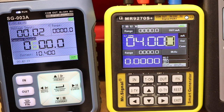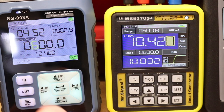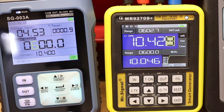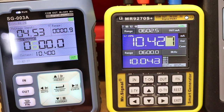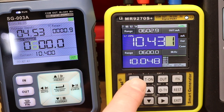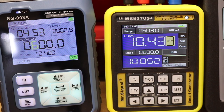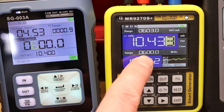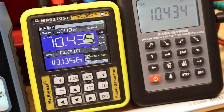Back to 600 RPM with the MR9270S running. We can see 600 RPM equivalent to 10.40 mA. The MR9270S shows 10.4 mA output and a frequency of 10.036 Hz - there's a lot more resolution on the frequency input. It's converting cleanly to 600 RPM. Swinging over to the LB02 it reads 10.429 mA - a good comparison.